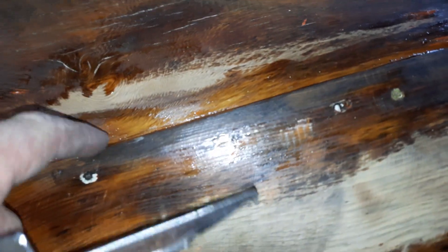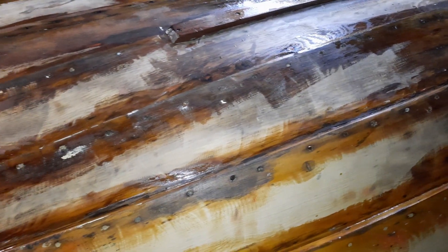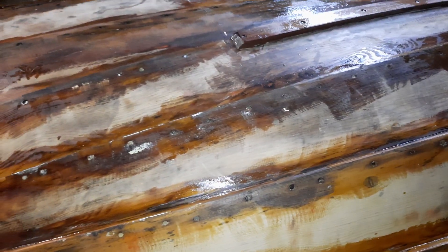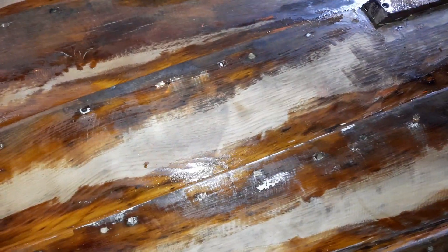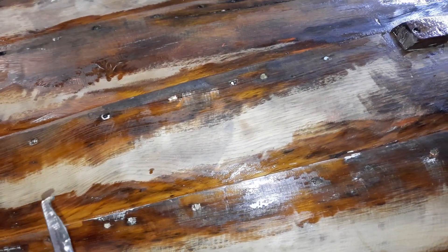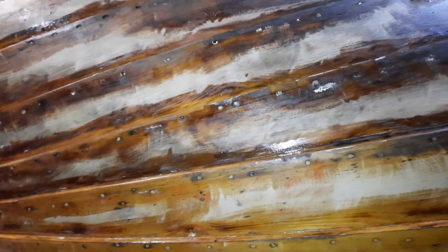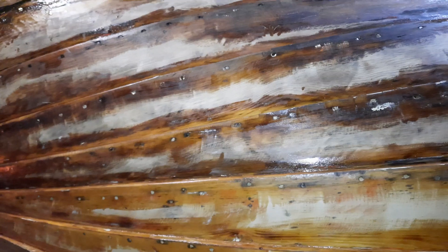That's going to make a really good bond — I don't expect any of this putty to ever crack and fall out. One thing you also want to do is go over it and check after you put it on, and wipe off any excess runs because they become hard to sand. Even though the epoxy has set, it's not fully hard — it won't go really hard for weeks or months — so it clogs your paper when you try to sand it. Always scrape off as much as you can.